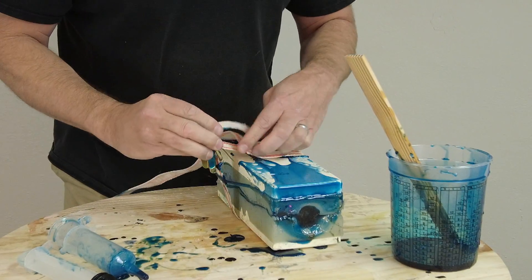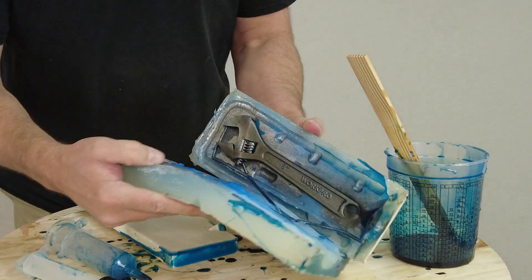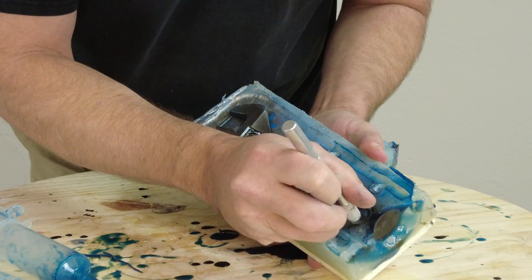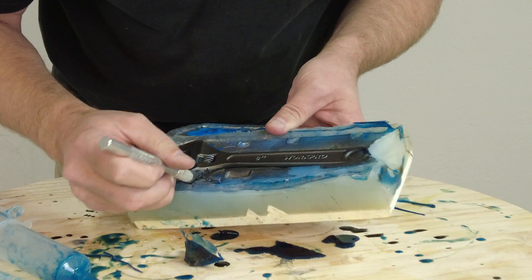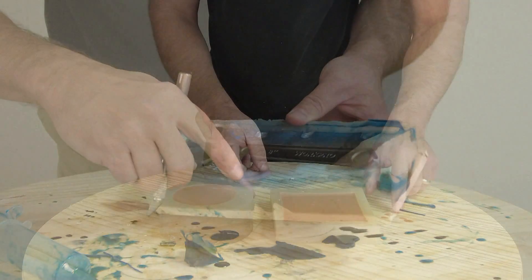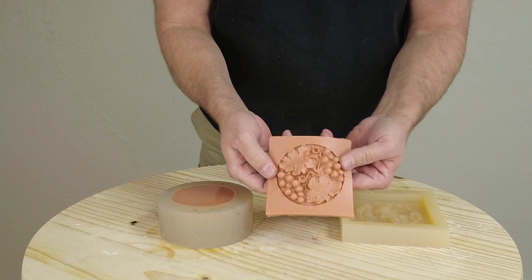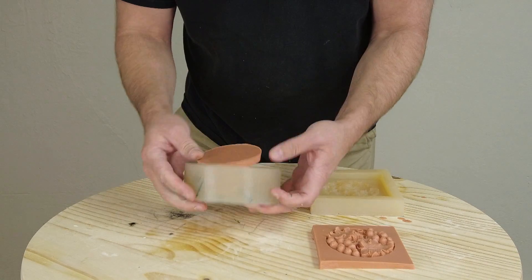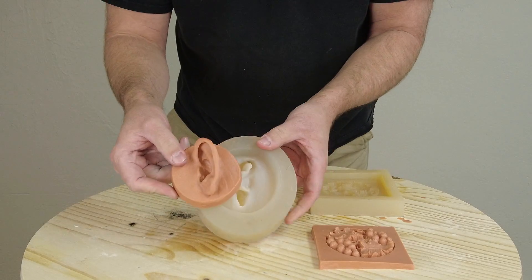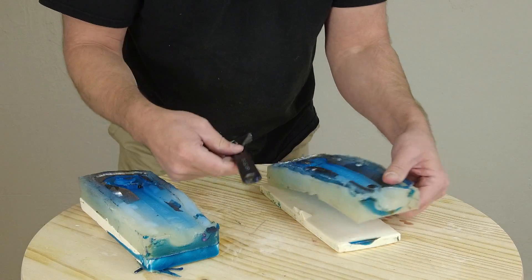About an hour and a half later — in a Texas winter where it can get very cold — I actually waited about two hours to demold. You can see the vent pull off right there. While it's still somewhat green and a little more flexible than the final cure, that's the perfect stage for trimming: removing flashing and sprues with an exacto knife or scalpel. The other test parts have come out beautifully as well. These are also still a little green at this stage, but this shows how you can use the flesh pigment for medical simulator applications. Many customers use the softer FP25 for gunshot simulators, backed with 266 flexible foam.